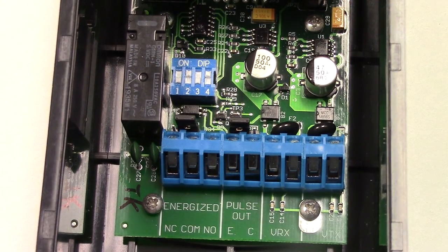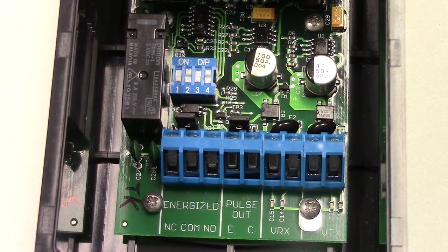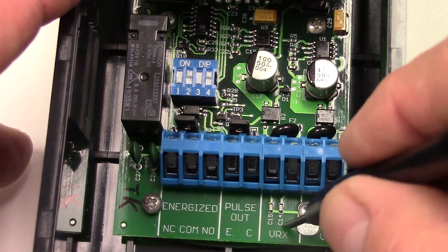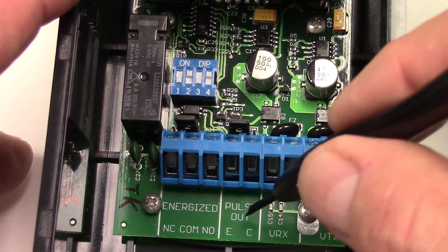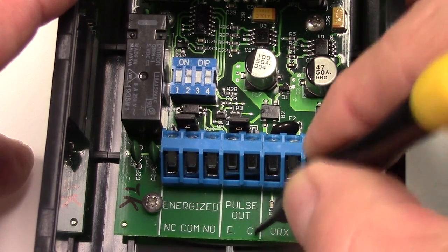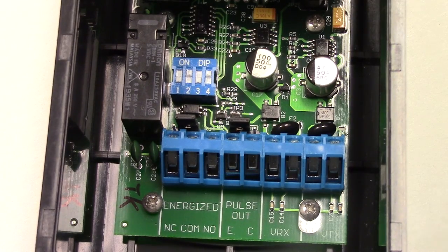Position two on selects the three-frequency pulsed output. Again, this can be operated in either the two-wire mode where the pulses come out on the receiver voltage line, or the pulses can come out isolated on an optically isolated line for the emitter and collector. The pulse frequencies are 300Hz, 2Hz for an obstruction, or 0Hz for a fault.